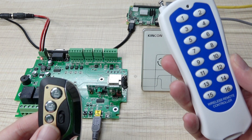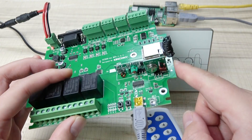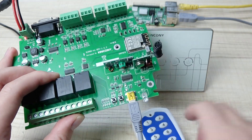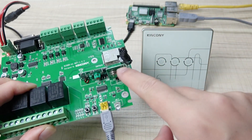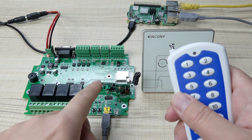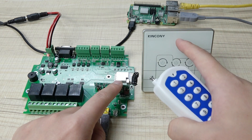So now I can use this mobile phone with Home Assistant, and I can also use this remote to turn on and turn off. Now I will show you how to trigger this button to the A4 board, and the A4 board sends the signal to control the switch panel. Even if you have any kind of remote — just a 433 MHz RF remote — you can trigger any button to the A4 board. You can see this is the A4 board. You can install the receive module. This is the RF receive module and this is the RF transmit module. So this is for decode — we can send this button signal. This signal is sent to this module, and this module will send the signal to the switch panel.